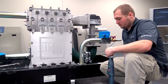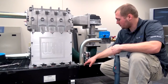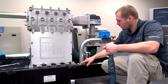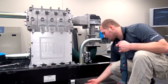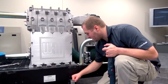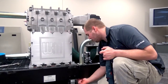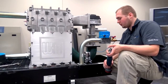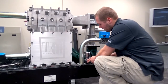We're going to be doing 2 separate things. Right here on the top, there's 2 bolts with washers. You're going to be using your 13mm socket to take these 2 bolts all the way out, as well as on the bottom side of this frame, it kind of overlays on the main portion of the frame. There's also 2 more bolts, one here and one on the other side, that we're going to also remove with the same 13mm socket. So let's get started.